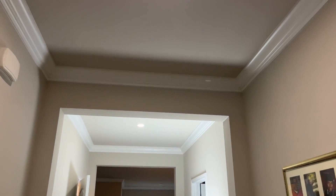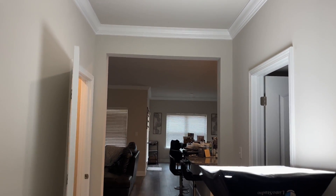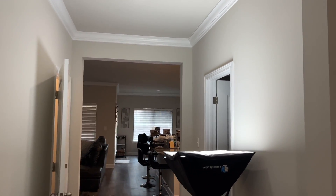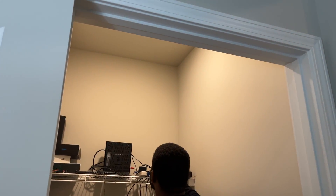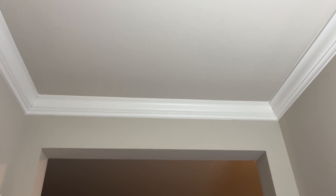This is the front entryway and foyer. We're going to mount the wireless access point right here, which is basically the most central point in the house. The master bedroom is that way, this is the living room, kitchen, and dining area, and to the left and right are other bedrooms. That's about as central as it can get. We could put it inside the network closet but the additional walls may interfere with the signal.